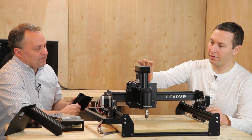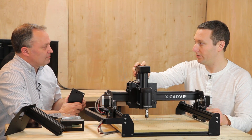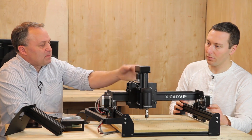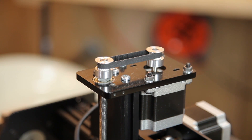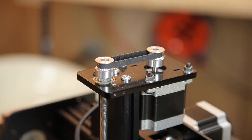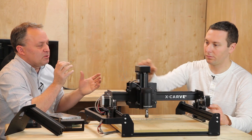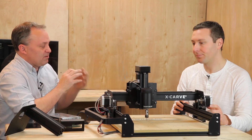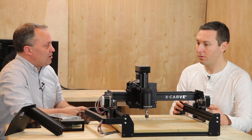One of the things on the Z is it looks way more compact than it used to be. What we've done is flipped the motor over and hooked it up with a belt — makes it much stiffer, less tall, less likely to wobble, and just significantly stiffer all around. It's using a large single plate, very easy to install, not a lot of multiple plates and pinch points and wave washers. It's just reducing the parts by quite a large amount.